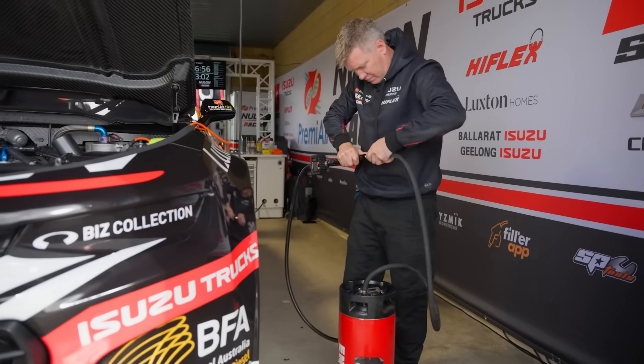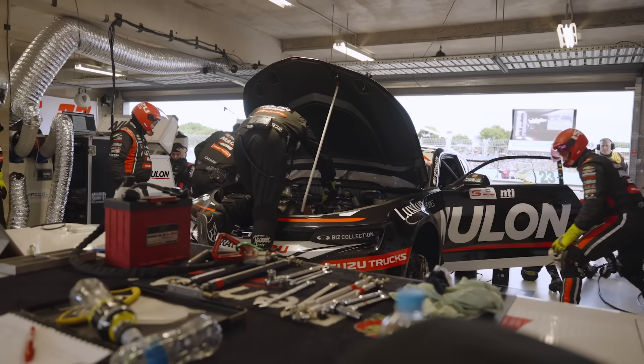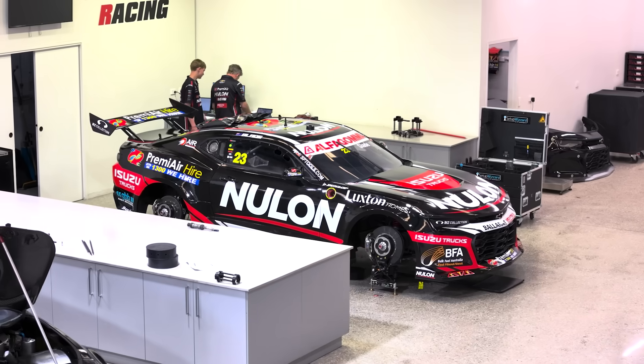When we fill the engine oil, we meter it through an electronic meter that tells us exactly how much oil we've put into the engine. Every night after we run, or maybe the following morning when we run the engine up, we'll check that oil level again and make sure that we're not burning any oil. Burning oil is another thing that would tell us we've got a problem that may lead to a premature engine change, and then we do the same when we get home.